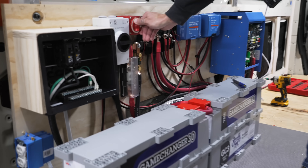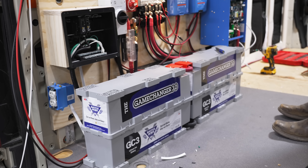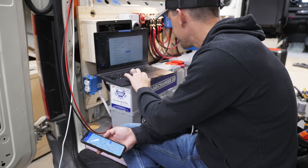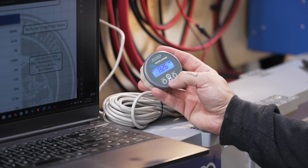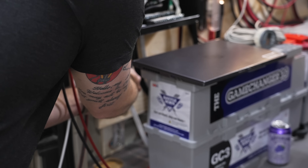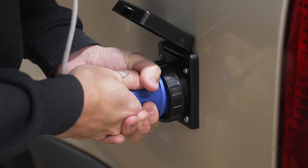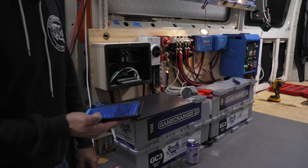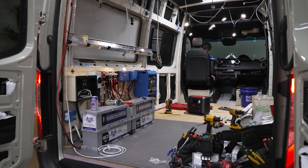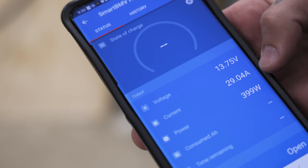We fired up the system — got light, no smoke, which is a good thing. After turning the system on, Nate went through the process of programming everything, which included updating firmware, setting battery charge rates, setting battery capacity, and more. Once the inverter was programmed, we could test the 120-volt outlet and it worked like a charm — we could monitor the draw in the Victron app. We tested the shore power charging, which worked as expected, currently charging at about 1,000 watts, so there's 75 amps worth of 12-volt current going back into it. We also tested the alternator charging, which worked perfectly — we could see we're charging at a rate of 29 amps from the alternator.